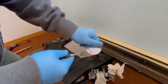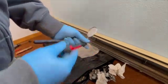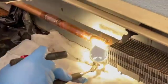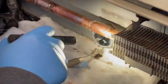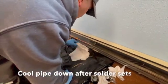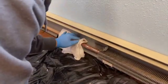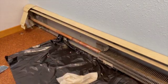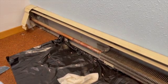Another good tool is a mirror so you can look at the joint all the way around, and a good flashlight so you can see in the dark. Last thing I'm going to do is take this wet rag and use it to help cool the pipe down. You also want to wipe off any flux that's left on the pipe so it doesn't start turning green and corroding the pipe.